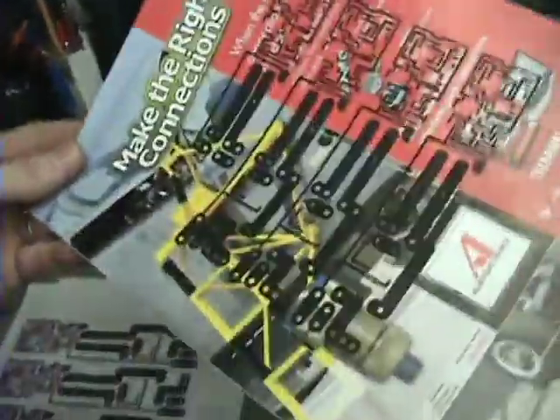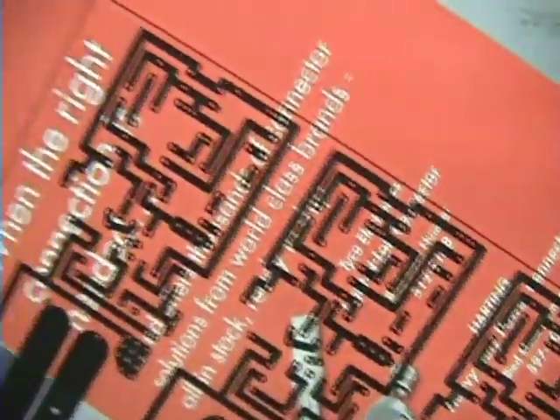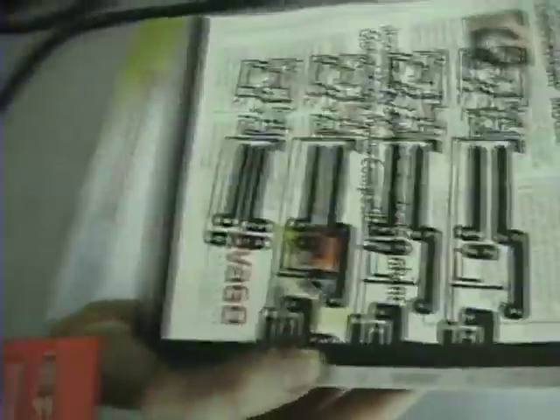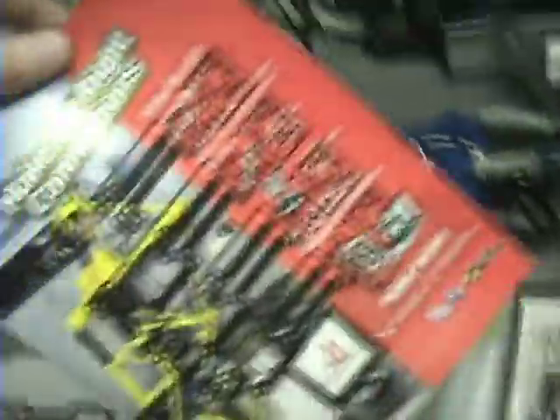You can see how the light reflects off the paper — see how shiny it is — but the printed circuit board area does not reflect the same way because that's where I printed. This is actually going to become your circuit board. You have to have a really high-quality printer; don't use an old cheap one or you'll get little pits from the roller and drum. I printed out two of these and I think this paper from the inside of the magazine is better.